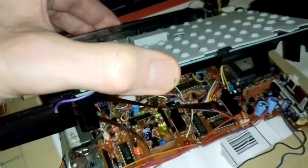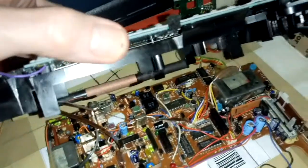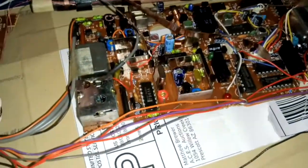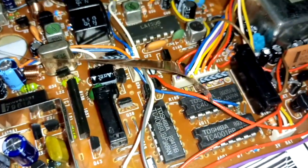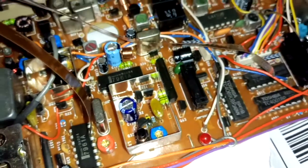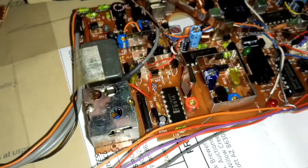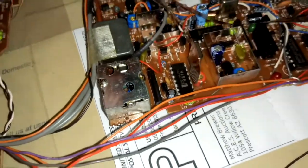There's your main board underneath — you can see the two cable connectors. I took this all apart, leaned it over, and used electronic circuit board cleaner on it. These two ribbon connectors just snap up and pull out. I cleaned up in there, and hopefully that'll resolve the contact issues — buttons not working and whatnot.